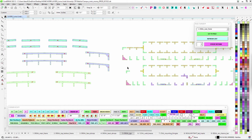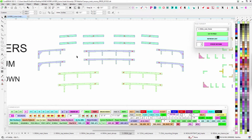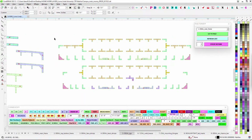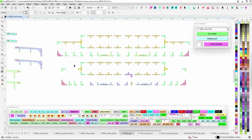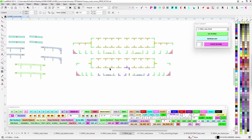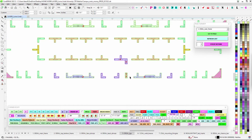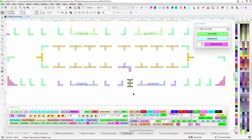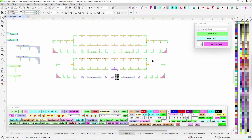And then there are so many jigs here that they get their own page, so you'll have your top curve jigs, 2 sets, you'll have your splices for those, and then you'll have front and back sets of jigs, since the sign is asymmetrical from the front to the back, so certain jigs are different for certain parts. Look for this little jig here. I mean, look for all the jigs, but this is a little separate nugget there.